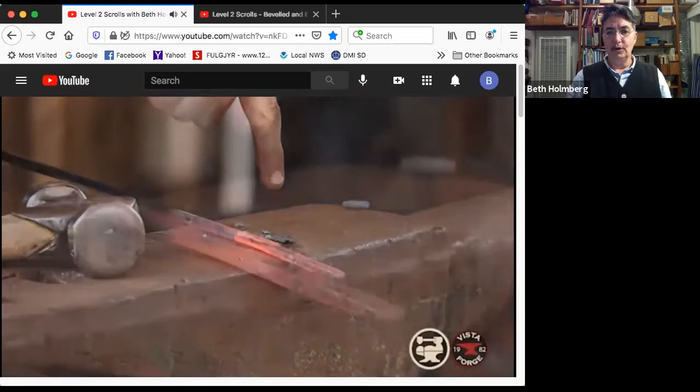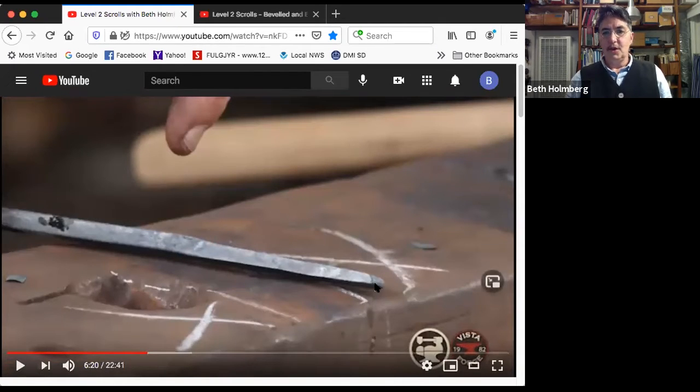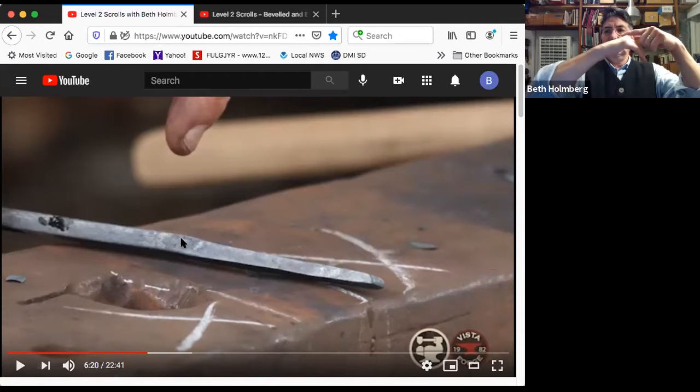I've also got a bulge problem, which I'm going to show you here. Let me jump to this one. So it's not very well tapered because I didn't start steep and work it back. And at the end of this very straight piece here, it suddenly becomes the full thickness of the bar, with no change in radius at all. I haven't feathered that in. So when I scroll it, it'll end up like my knuckle sticking out on the top, even though the inside is nice and smooth, and it'll make your scroll look really ugly, even when you've mostly done a decent job.